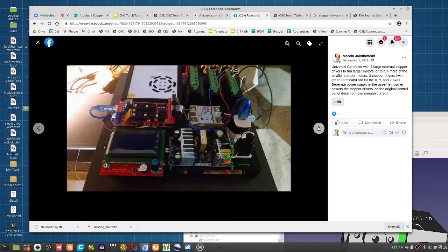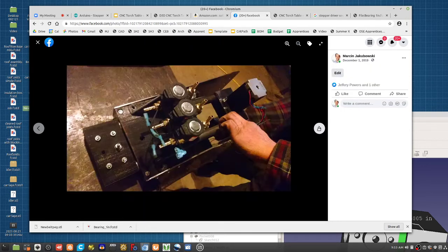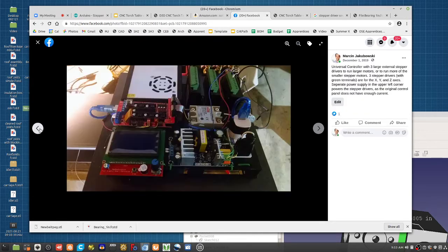So if you wanted to control one of those relays for gas right from that, you can go straight out of that. Now the other terminals, I think, are lower amps, and I don't know if they can support 2 amps even, but if they don't, you go through another power element, like a relay. This is a solid state relay here that we use for heat. You can run the wires into the solid state relay and then control other things. There's also all the pins that are available there. There's a bunch of pins that are still free, and you can use those as signal pins for other turn on and turn off. You've got access to 3 sensors immediately, like temperature sensors on the RAMPS.